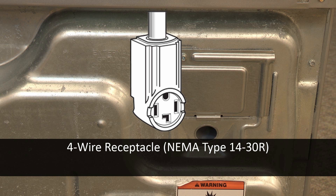Fire hazard. Use a new UL-listed 30-amp power supply cord. Use a UL-listed strain relief. Disconnect power before making electrical connections. Connect the neutral wire to the center terminal. The ground wire must be connected to the green ground connector. Connect the remaining two supply wires to the remaining two terminals. Securely tighten all electrical connections. Failure to do so can result in death, fire, or electrical shock.